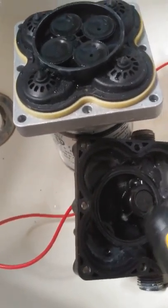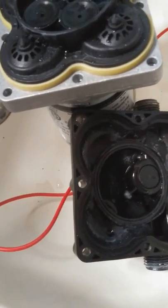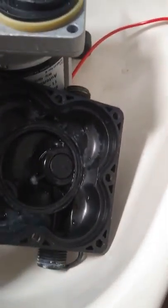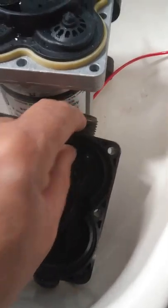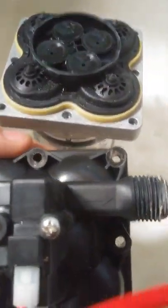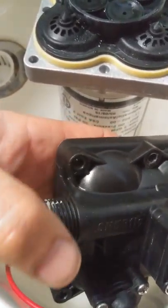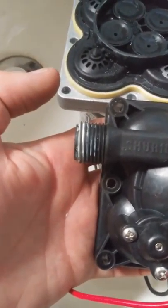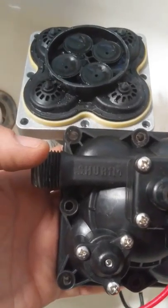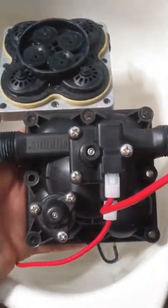So: tap on it first, then look for debris in here and check your check valve — make sure it's moving. They do make a screen that goes on the end of these ports. A lot of people don't bother, but it's a good idea to invest the extra $10 or $15. It threads right on the input side of the pump — there's an arrow on there marking the output side, so you put it on the input side. It looks basically like a medicine bottle with a little screen in it. Thread that cap off once a year, wash the screen out, put it back in, and you'll eliminate a whole lot of problems.